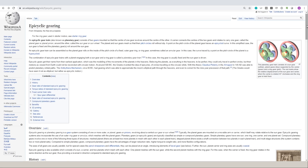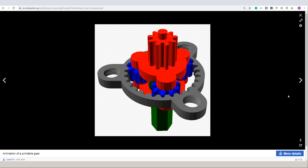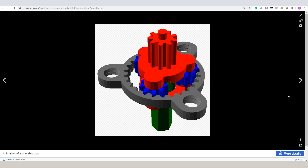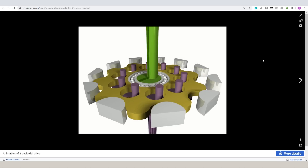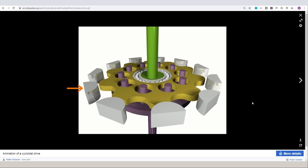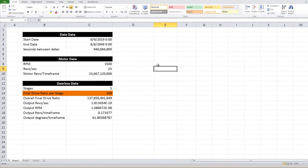Let's take a closer look at some of these gear train systems. That motor I mentioned from the rifle target was a planetary gearbox — it uses multiple stages of this sort of reduction. Many planetary gearboxes still only have a fraction of the gear reduction in a single stage, so in the case of that Strike Mark motor, we needed three stages to get the RPMs down. Hypocycloid gears work in a totally different manner. Here the green shaft is our higher RPM input shaft, driving the gold-colored platter at an eccentric location on that bearing. As the cycloid disc rotates, it meshes with those hemispherical objects and drives the purple output disc at a significantly reduced gear ratio — in our example, 169 to 1.